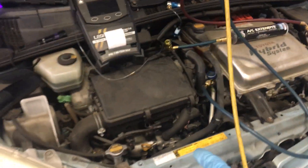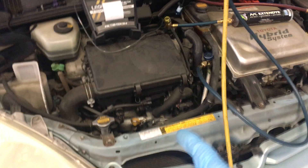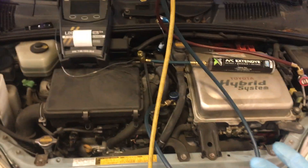Here's a 2000 Prius — the air conditioning condenser: is it leaking? No visual leak like you usually see with the older Prius, but that doesn't mean it's not leaking. I didn't get information on whether this Prius had been sitting without air conditioning for a long time, so I have to go off of what I know. I was given no information — it had zero PSI.